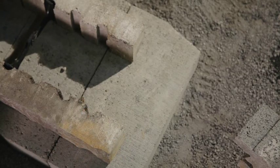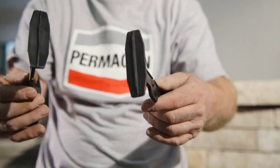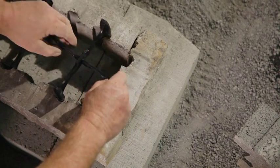The end of the double-sided wall is completed using textured veneer unit A, which is installed at the end of the wall. To ensure a solid corner assembly, two double-sided connectors are placed in a cross shape and inserted into the mortises on the veneer unit.